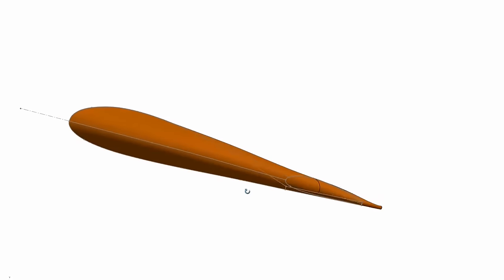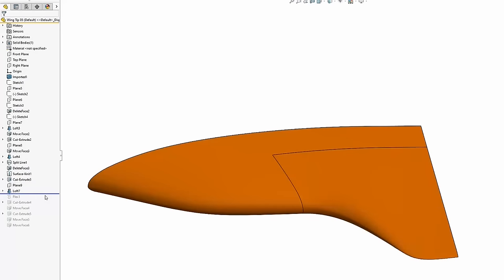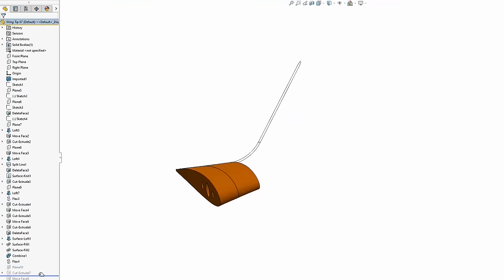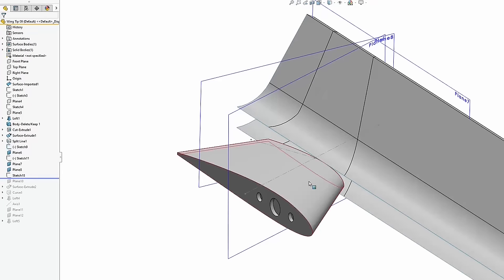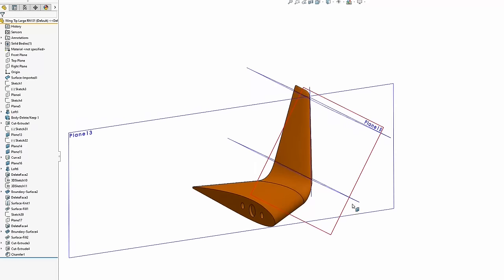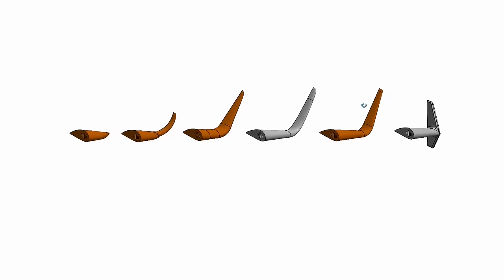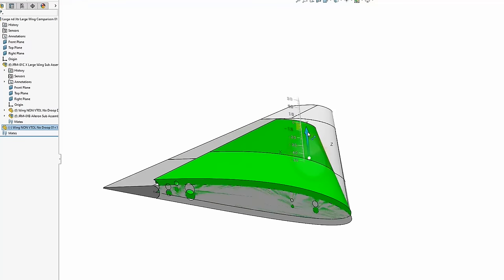For the design of our very early winglet, I worked on the basis of using NACA profiles, from which I then lofted small extension features, and then using the flex command in SolidWorks twisted this particular winglet upright. One of the issues with the flex tool is that it bulges out the geometry. And in this instance, we got this particular design. The last of our profiles was the Lazy Man winglet. In the process of completing our design testing of each wingtip, the root profile is the same on this particular design so that we can swap them on the aircraft.